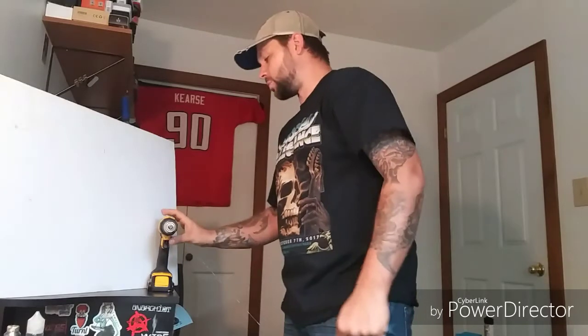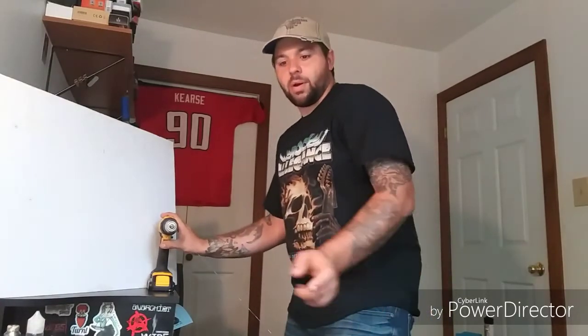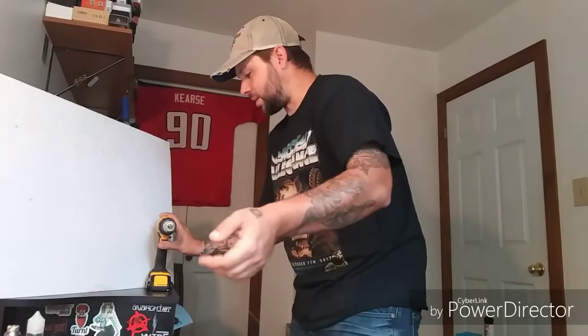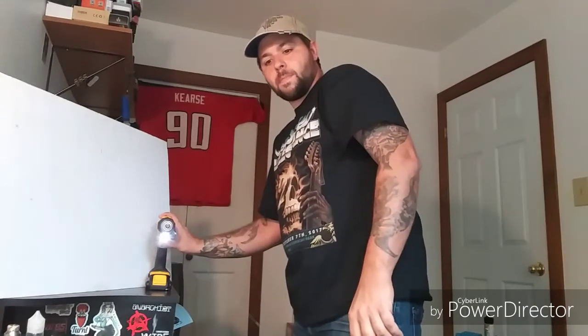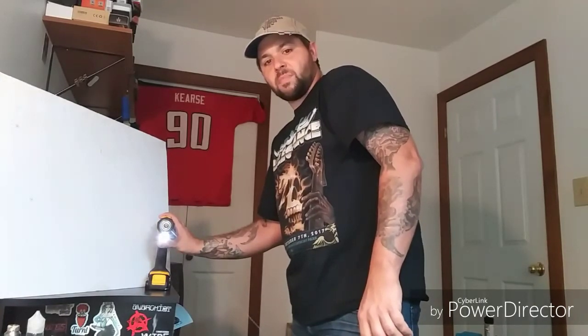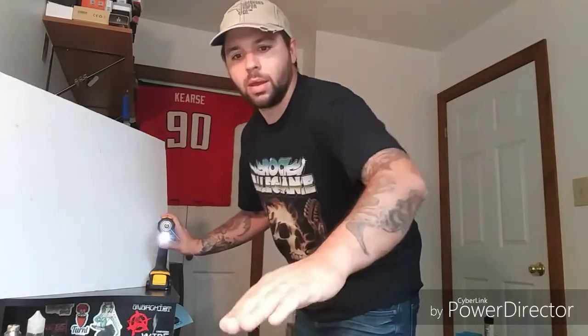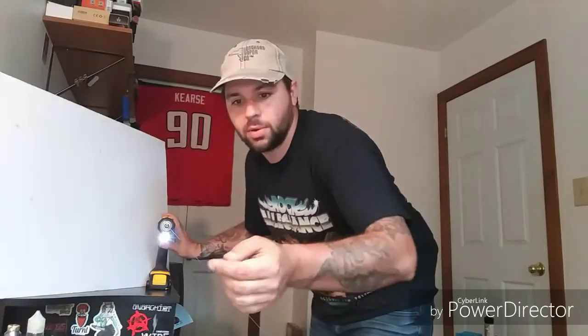When you twist something like wire, it's not going to twist evenly from here to here. It's going to start in one spot, and that one spot's going to be the tightest spot that you have pulled. So you want to pull nice, even tension. You want to have good tension on this while you're twisting. So I pull it back pretty hard, enough to just make the whole wire, you know, almost like a guitar string. You could actually see when the twist gets even, if you have some good lighting and something on your table to contrast the color of the wire.